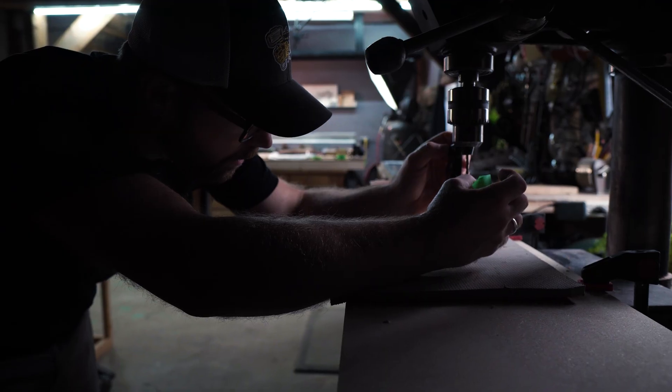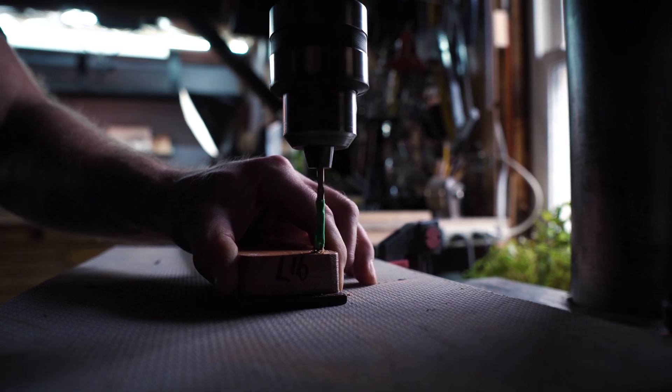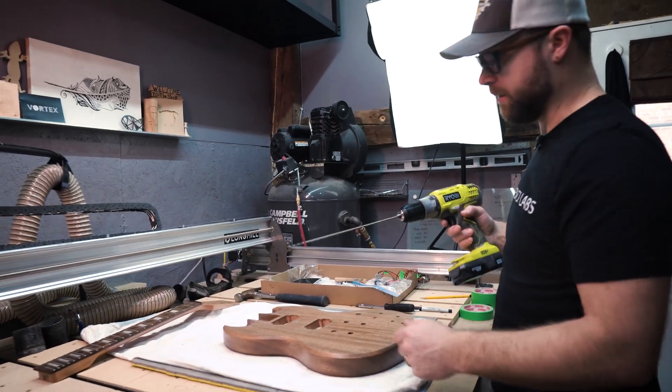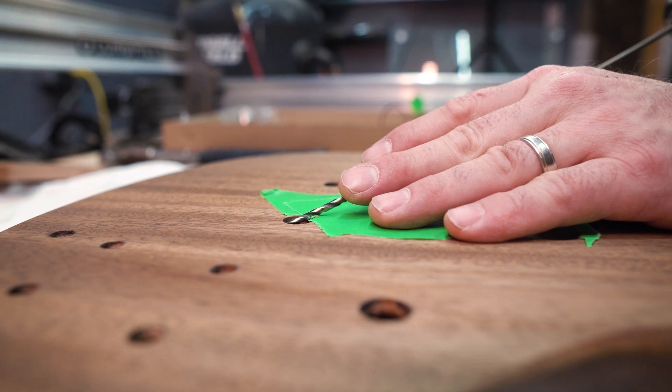A piece of tape on your drill bit is a good visual guide for depth. Next up, the long drill bit for the pickup and ground wires. The long drill bit allows some more shallow angles so that you don't have to worry about drilling through the body by accident. Drill the holes so you can feed the pickup wires into the control cavity and the ground wire from the harness to wedge beside the tailpiece post.